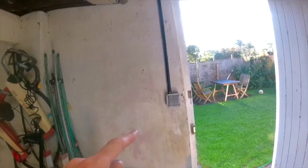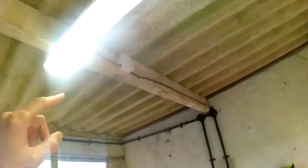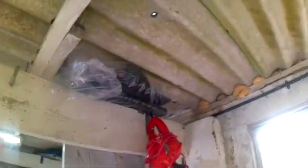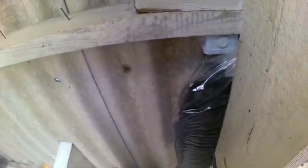What I did was connect them all in series - I wired all the cables along, and then when I got to the end I didn't read the instructions. So I wired the cable all the way along back to the switch, however that wasn't the way to do it. I messed up and it blew the fuse. What I should have done was put a switch at that end. I had to take the cable coming from the light all the way back to the point before the first light, and now I've brought the cable from there across to the switch.